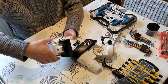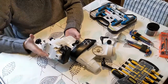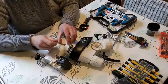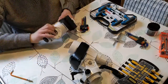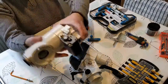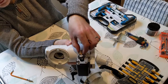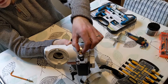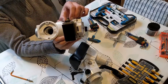It doesn't actually move freely — it really should just fall down and be smooth, but it's really quite stiff — so I'm going to take all of this apart. There we go, that's the first axis removed. You can already see if you listen very carefully there's backlash between these gears, which could be improved quite a lot. This is good — this is what I wanted to find out. Is there backlash? And we've confirmed that there is.